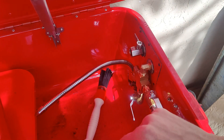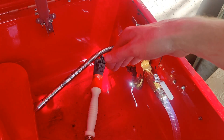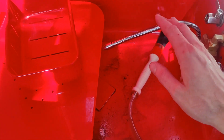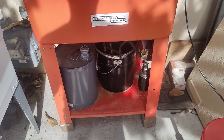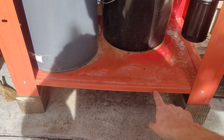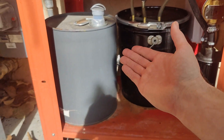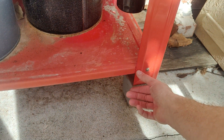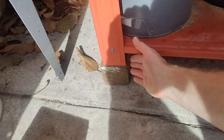Now let's take a look at what I ended up with. Inside you will see that the pump has been replaced with three outlets for the new solvent pump system — I have a brush, the nozzle from the old one, and just an open valve on the bottom. There's also an air breather valve on the top next to the other valve sets. Moving to the bottom, you can see I dropped the shelf down and now I can fit two buckets down here. I also added four inch wood blocks to raise the whole assembly up a little bit and get more space for that mid shelf.